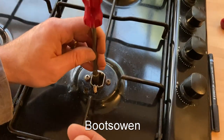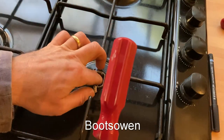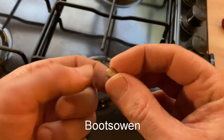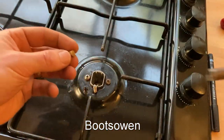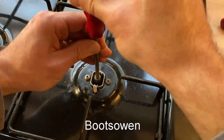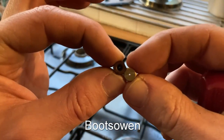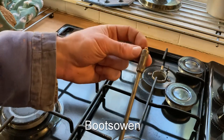This is a nut driver, 7mm — that's the right size for these. Take off the cover and then just unscrew them. Getting them out is a trick because they're really small. That's the old one there — put the new one with the smallest number in here. You can see the difference in the hole sizes; quite a difference to allow for those different pressures. What I try to do is get that in there, hold it in, drop it in position, then thread it in carefully — make sure it's not cross-threaded. Same on the back. Let's compare them again — you can see the difference. This one has a little cup on the top, but also the hole is way bigger on the bottom. What seems to work is putting the new jet into my nut driver and holding it with the tip of my finger.